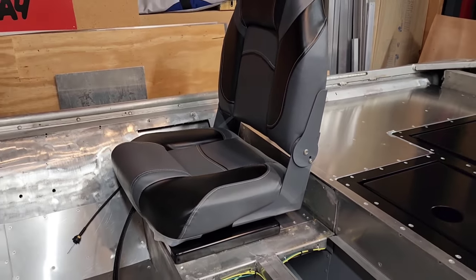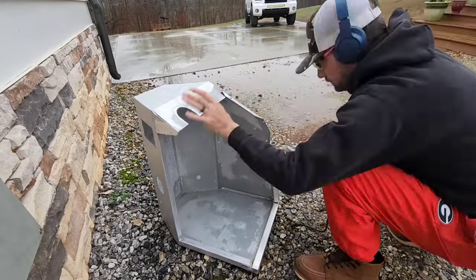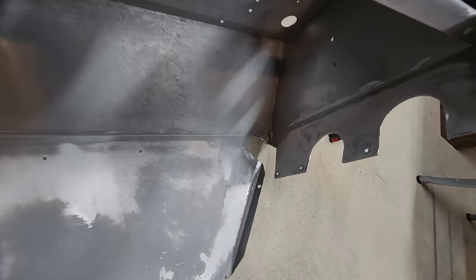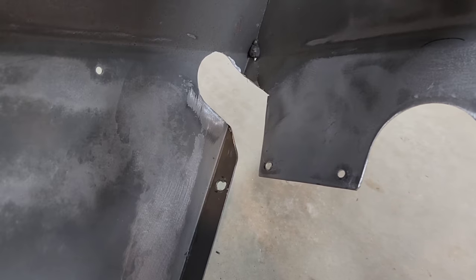on the bench top. Because the new lids and seats sat a little higher than the factory ones, and the new aluminum cockpit floor is much thinner than the original factory plywood, I had to make an adjustment to the console to get the correct height. I cut the flange on the bottom and added 1x1-inch square tube to the console base. I also made adjustments to the notches in the side for the steering cable and wiring clearance.